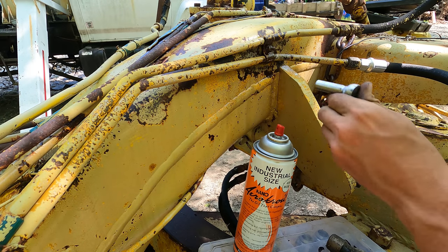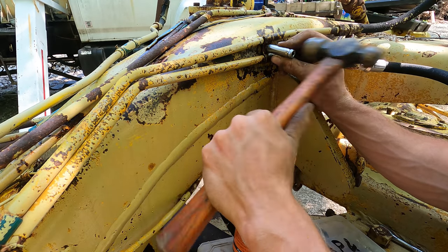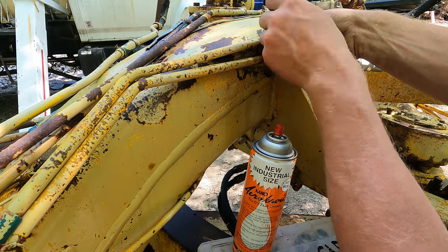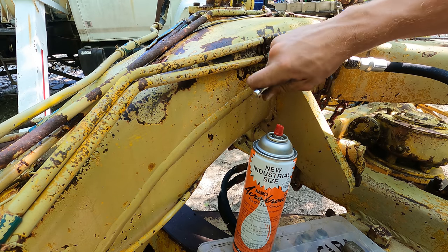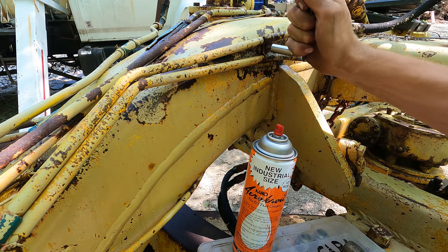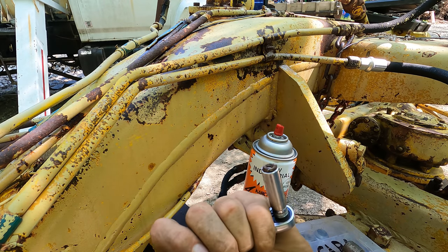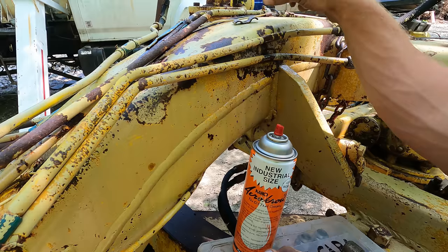This bolt is actually rusted down between sizes. I can kind of tap a 10 millimeter on it. Trying to be kind of careful because I'm afraid we're going to actually break the stud right off the frame here. I do have it moving, which is impressive enough, but there's a lot of rusty threads we're cutting through. This is like the third or fourth time I've moved the nut in and out on the shaft, trying to clean the threads up a little bit without breaking anything. Started out with a 7/16 and went down to 10 millimeter to get it off of there. But it came off and that's impressive. And the stud actually doesn't look as bad now.